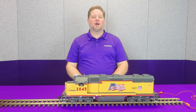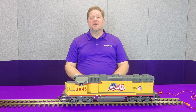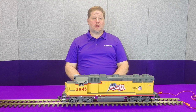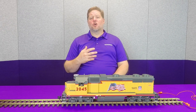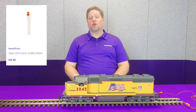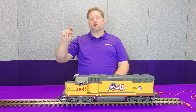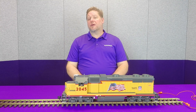I attached the V plus to the common lead of the white LED, using only one color. Given how class lights work — in this era most trains were designated as extras, so you'd only really see clear; green indicated a scheduled following train, and red was for pusher units on the rear — neither non-clear color would be used often. So to be able to demonstrate the light I replaced them with our 810-134 golden white LED, bent the leads so they angled into the housings, and wired them up. The resistors were already on the little circuit boards, so after all that I got everything wired up together.